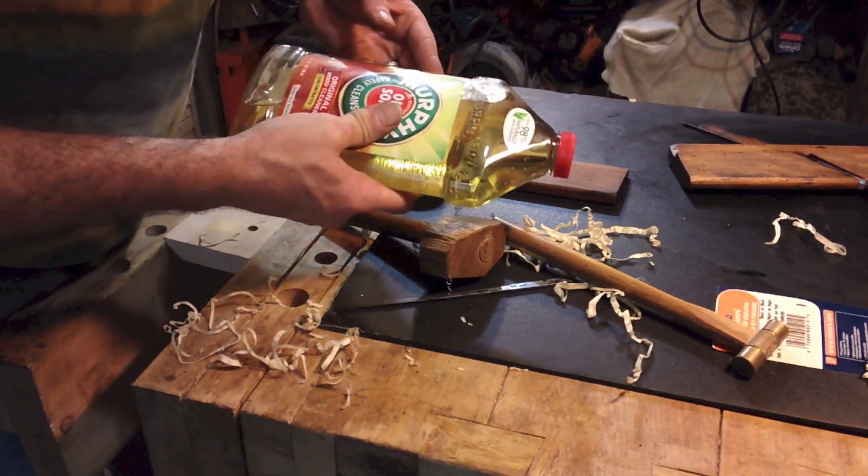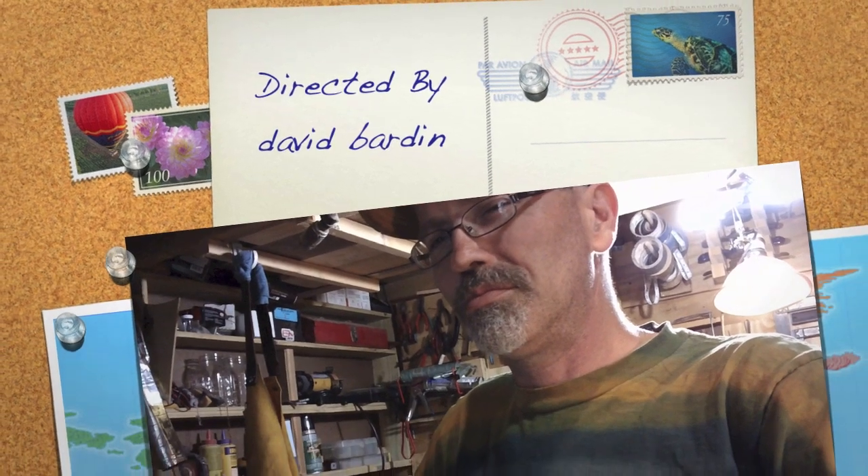Lesson learned, and that was the path we were headed with this — to see how it worked. Well guys, that was my first time trying that mixture. Normally I use pure turpentine: clean the plane with steel wool, then BLO it, go through the procedures of putting it through the grits, get the iron cleaned up, square, shaped, flat, sharp, and put it back in and put it to use. That was again my first time. I do like it — it worked well. On bigger planes it'd be fine. If you're getting down to the real thin ones, the eighth-inch, or anything with thin walls on molding planes, you may have to wait and see. Out of five stars: four and a half. Thanks, see you soon.